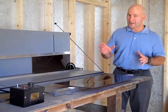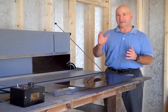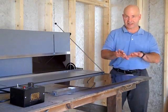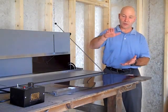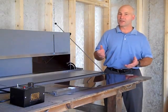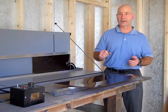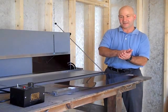We also have other bending equipment. If you go to our website or look in our catalog, we've got bending bars. We've got a bending sword — it puts a groove into the plastic, kind of displaces the plastic. We've got a pneumatic bending table, which will heat both sides. You would want to use that for thicker plastics, maybe like 1/4 inch or 1/2 inch acrylic, where you've got high production and you want to heat both sides at the same time.